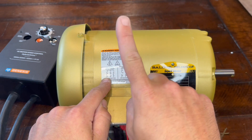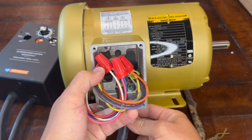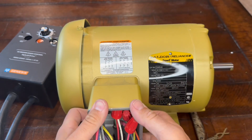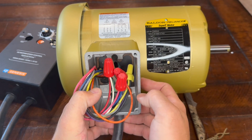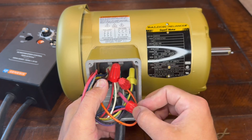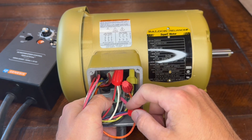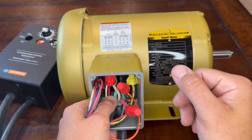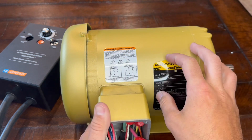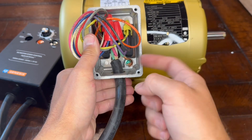I have one and seven plus one of my leads from the VFD capped together. You can see here's my lead coming in, and it's capped off with two of those wires. The order doesn't really matter because it's AC. If this was DC, it would matter more. You're not going to harm anything. But with three-phase like this, if the motor is turning the opposite direction you want, what you just got to do is swap two of these wires — swap them over to white or vice versa — and that will reverse the rotation of your motor. It matters more on things like belt grinders. For this disc grinder it doesn't really matter, and we're going to have a forward/reverse switch on here. Also make sure your wire is grounded — green's always ground — so it's got to be grounded to the frame of the motor.